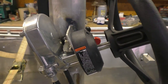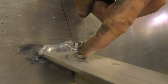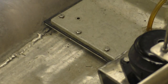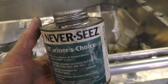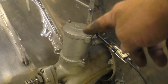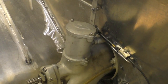Not very quickly anyway. Steering is all in place and in good shape. You see the way we did our studs to hold down the deck — it's just a bolt run through with a lock nut, only about as thick as the metal that comes down onto this. Then that wing nut will go over the top to hold it all down. Every bolt in there now has never-seize on it, just gives us a better chance of getting it out later on. We'll have to extend that clean-out because our water line is going to be about four inches above the top of that — if we opened it up while we're in the water, it basically floods the boat, so we'll have to do something about that.